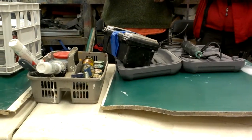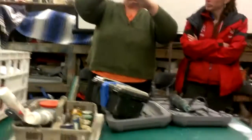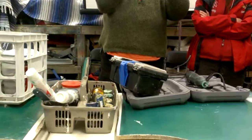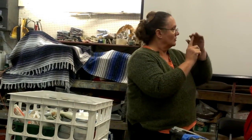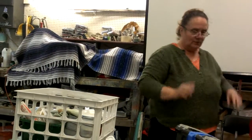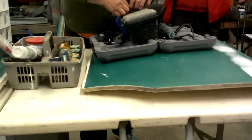Little section out here on the side, you're going to be making a long bevel through your good gel coat. So as you're putting your new gel coat in there, in that little section that's your halo, your edges, you'll get a little bit of the old gel coat color helping to fool your eye. So that's part of the right way you do that.